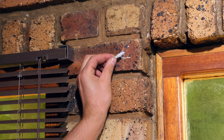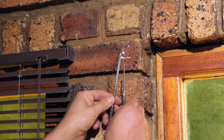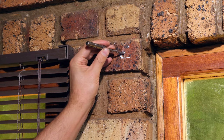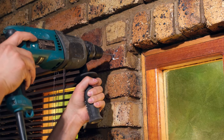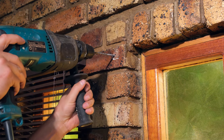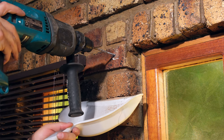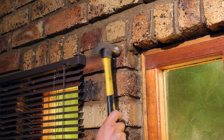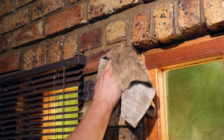The plugs that came with the unit are six millimeter. Because this is masonry I'm not going to drill a six millimeter hole right away — I'm going to drill a pilot hole with a smaller bit, because the bit tends to move when I start drilling and it's much easier to control a smaller bit. Now I can go ahead and drill the six millimeter holes. Then I insert the nylon plugs, take some alcohol, and remove the correction fluid markings.